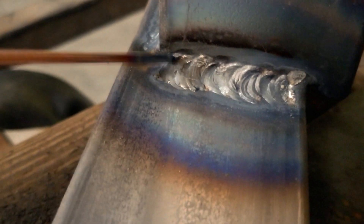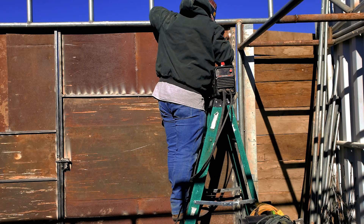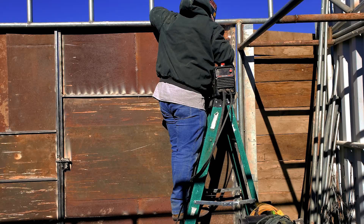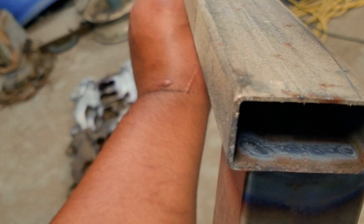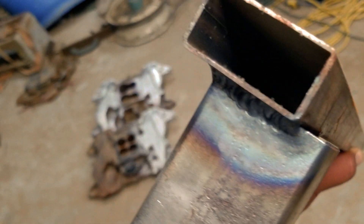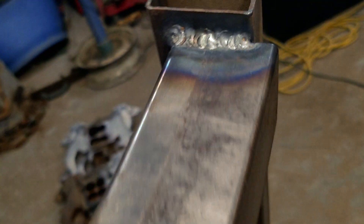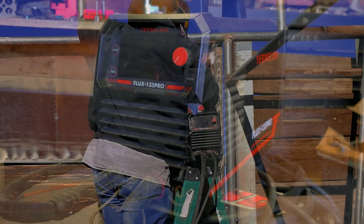This one was the best of the TIG welds — pretty uniform, with a little contamination at the end where something caught fire, but it doesn't look too bad for a novice beginner TIG welder. More importantly, do the welds penetrate? If you flip it around and look inside the tube you can see a gray-blue line along the sides, indicating the weld puddle came through. The molten gray-blue color tells us we were probably getting more than enough penetration on this 16 gauge steel.